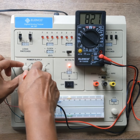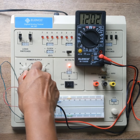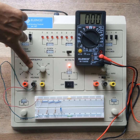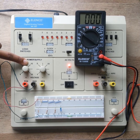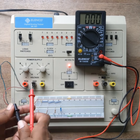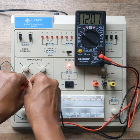Don't just turn the knob and assume the voltage will be what's shown on the dial — these are not very accurate. Set up your probes to measure what's coming out and slowly turn the knob until you get close to the voltage level you want. In this case we want 12 volts, so I'll stop at about 11.98 volts. Now that the voltage supply is set, notice where the knob is — 12 should be over here, but I actually confirmed it by measuring it right here. You have to measure it to make sure you're supplying the correct voltage.